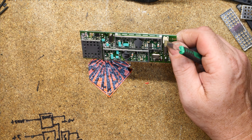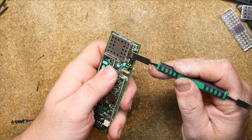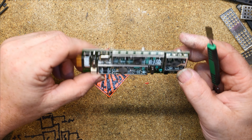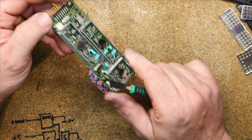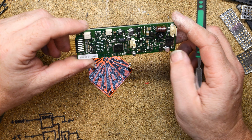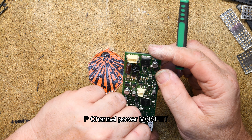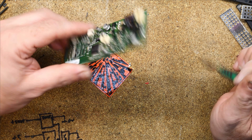I wonder if we are indeed driving that orange wire in the wiring harness as an antenna. But it also makes me wonder where the intelligence is - is it all in that chip? Again that is all passives. So my guess is we have a receiver, we have a transmitter, possibly a mixer there. And then this is obviously quite highly custom, so there is a MOSFET there - SFW9640. What would we be doing with that MOSFET? Because that MOSFET is capable of sinking a lot more power than that edge connector would ever handle.